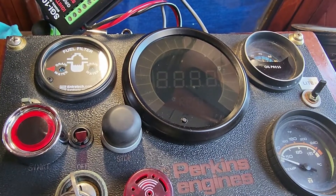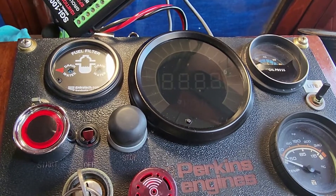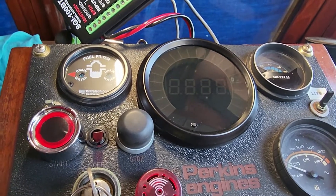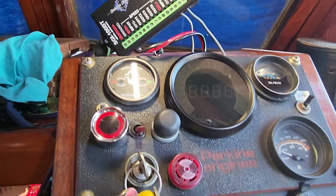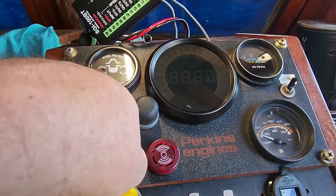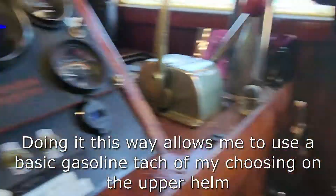The key is not to skew the whole range — if you get everything perfectly accurate at 700 RPM, it may or may not be off at 1500 RPM, and may be off more at 3000. You have to hit the middle, so aim for around 1500 RPM, or wherever you operate most. With this three-component setup, it's apparently within about ten RPM — sometimes dead on, sometimes about ten off. When you power it up, it goes into test mode and cycles through all those modes.